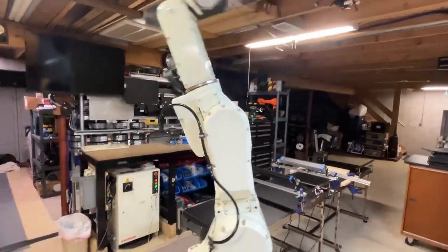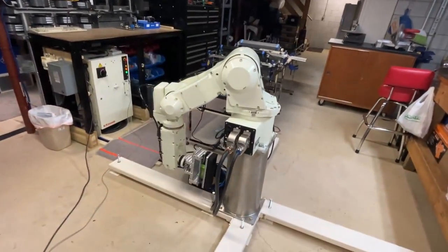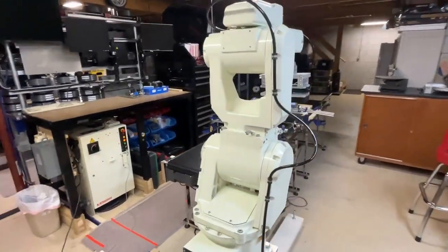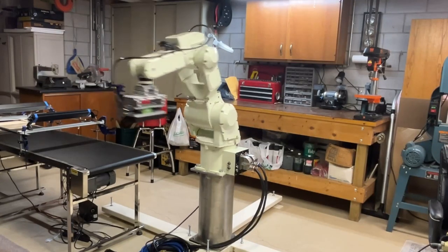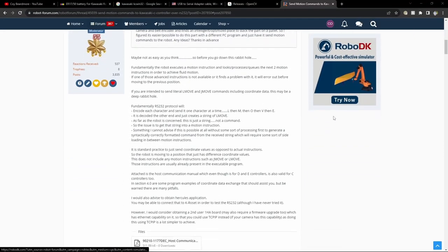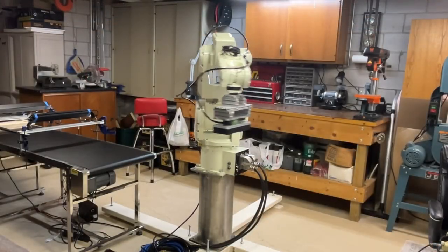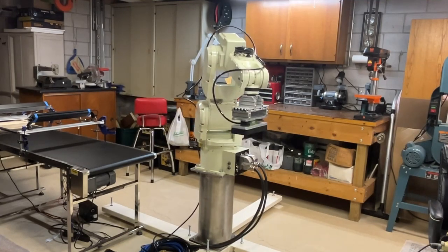Now the only thing left to do is to get my program to talk to the robot controller, which wasn't going to be as straightforward since I'm using a Windows 10 PC that's trying to talk to a 25-year-old industrial robot arm controller. Now again, very smart people helped me through this on Robot Forum, which I'll also link below. What I ended up doing is setting up the host comms option on the controller that uses the second port to communicate over RS232 to my computer.